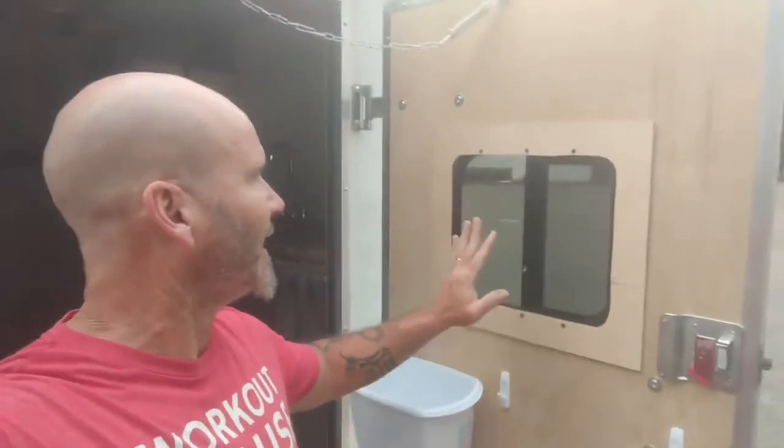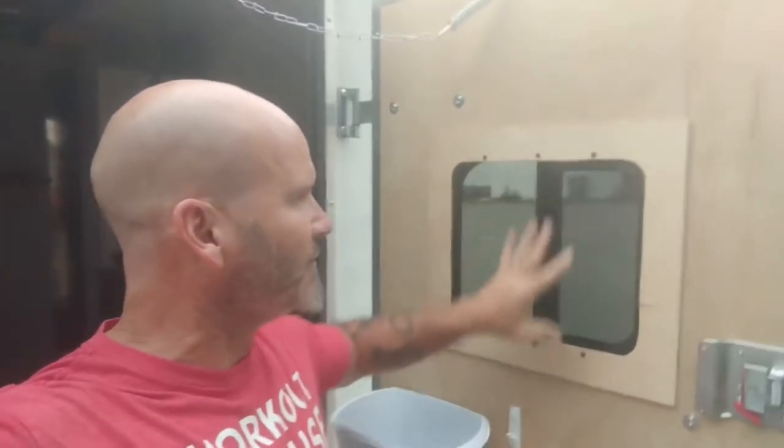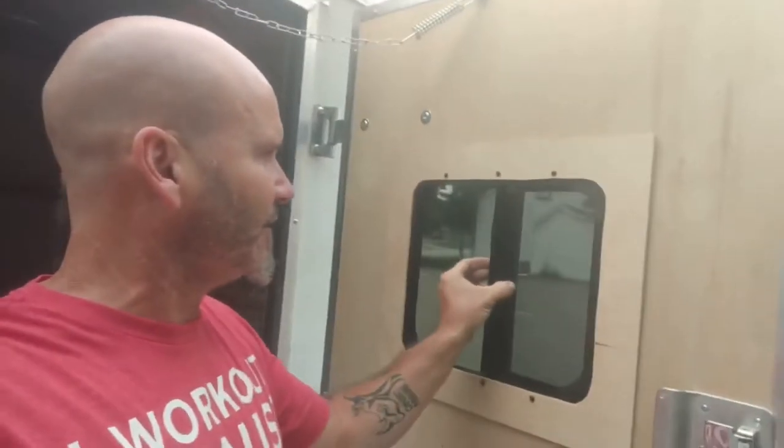So the day is done — it was not what I expected but I did complete it. Here's what I did: I got a little frame, cut this thing out — it's not perfect but it'll do for now. This is framed around and then drilled into the side of the window here. As I mentioned, the door is too big for the window that I bought, so the original bracket wasn't able to work. I kind of jerry-rigged my own way and it works. The window slides open — still kind of drying, so I'm not going to go overboard, but it works. Window complete.